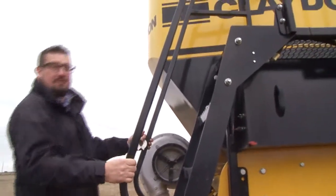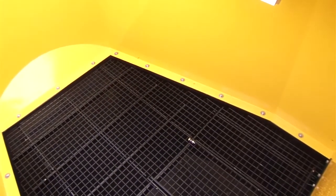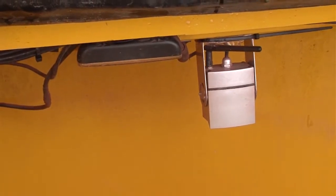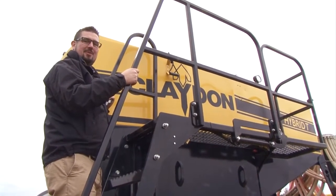There is a massive 5,500 litre hopper that carries about four and a quarter tonnes of seed, or it can have a 60-40 split of seed and fertiliser. Inside it there is a light and vision kit so we can see what's happening at night with the lights on or with cameras in the daylight. There are also low-level hopper sensors to let the farmer know when he's getting low on seed.